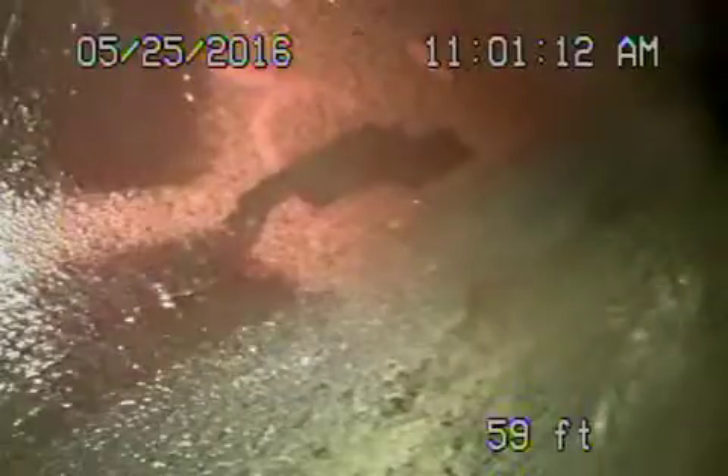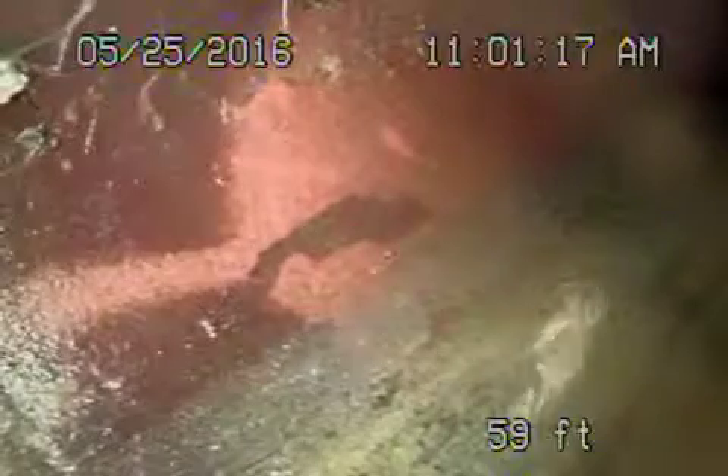Right now we're running downstream where the sewer line goes into the street on Sandal Lane, and there's the city sewer right over there. You can see it flowing by. We're going to pull the camera back over here — this section of 6-inch clay lateral. It looks like it's in pretty fair condition, and then it comes onto the property with a 4-inch ABS pipe.